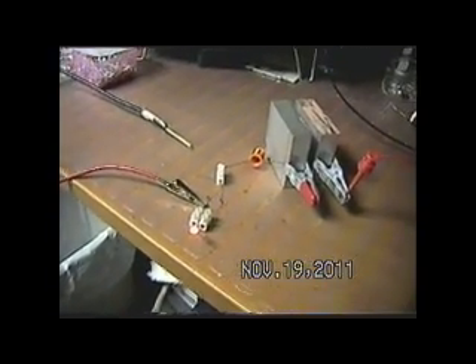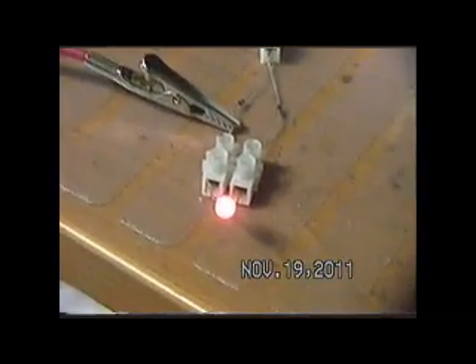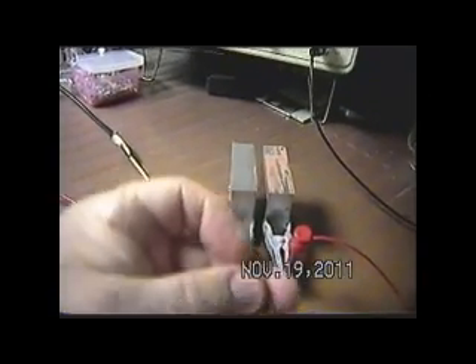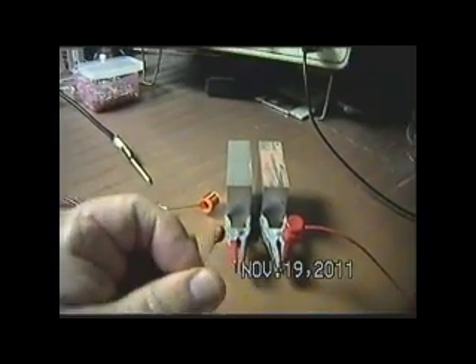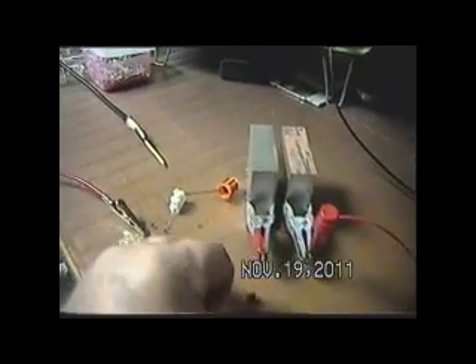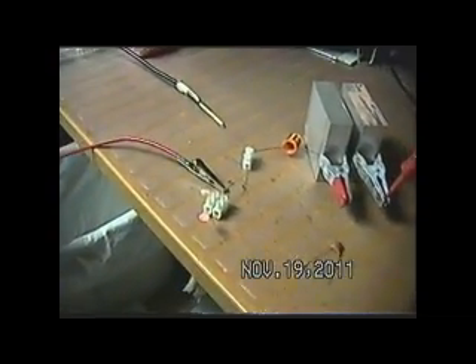Let me show you the difference now. What I've done is — you can see the intensity of this red lead right here with that coil, 92 megahertz, the two aluminum blocks separated by one centimeter, and single lead feeding this side. Now what I have here is an NPO 10 picofarad capacitor. And I'm going to take and remove the coil from this aluminum block, hook it up with a connector, hook the generator into it, and see what the response is.